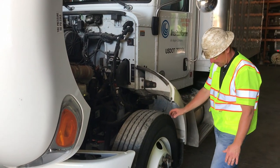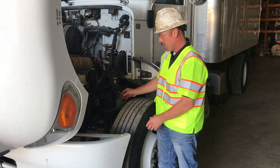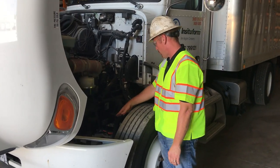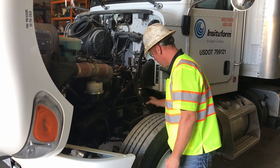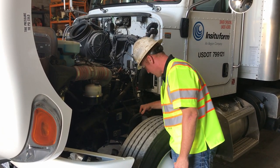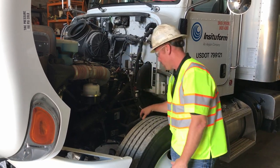Check your tire, make sure it looks like it's inflated properly, check the pressure on it. Check your suspension parts, your springs, your shackles, check your brake chamber, your airlines, keep your electrical connections that hang down — make sure nothing has abnormal wear.